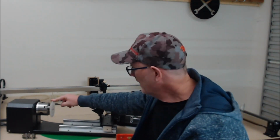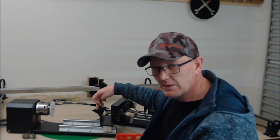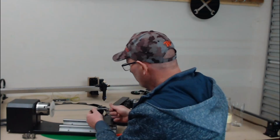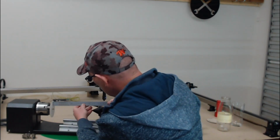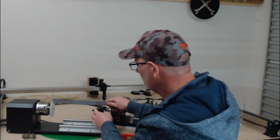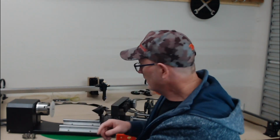With our chuck rotary axis, we're limited by the distance or the height of the object that we can engrave on. So with the pad that I've got in place here, we're looking at a maximum length of approximately 210mm. And even with this out, it only gains us about another 10mm.